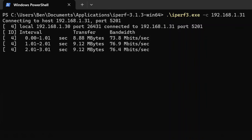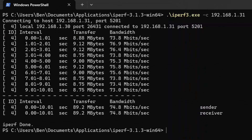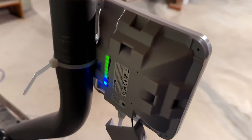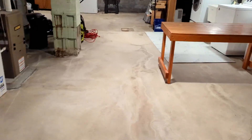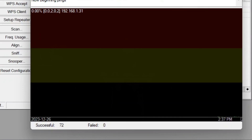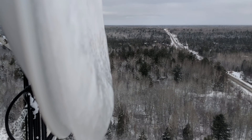The 74 megabits per second is a little lower than expected, though iPerf 3 uses a lot of small packets which weaker CPUs can struggle with. I expect full-sized packets common with internet traffic like file downloads and streaming video will max out the 100 megabit port. The latency is very low and consistent like many of the other 5GHz products I've tested. I've used some of MicroTik's 802.11n products to deliver fixed wireless internet service at work, and they work reliably even despite harsh weather.